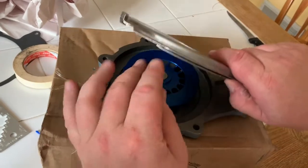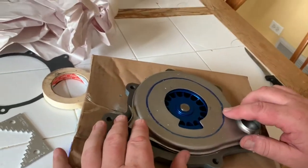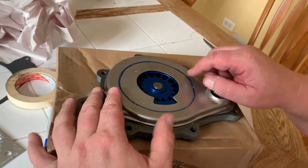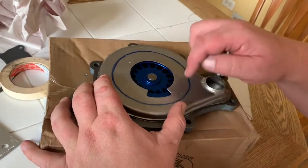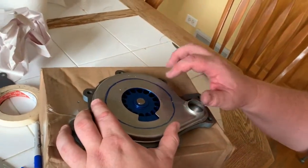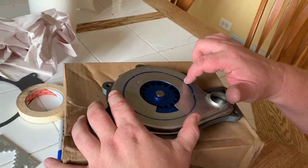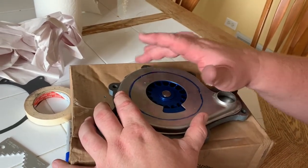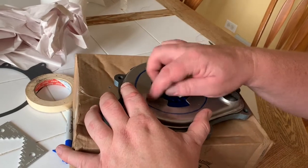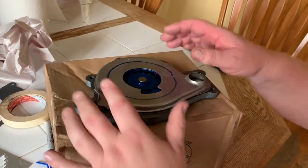See the outside of that impeller? You do not want to knock down the edges so much that you bind up the far outside of the impeller. That's another reason the blue line is there — you have to concentrate on manipulating the metal from the blue line inward. You have to take it down a little bit at the edge, but the majority of the manipulation goes from the blue line to the center. That's where the tolerances matter. That's it, end of video.